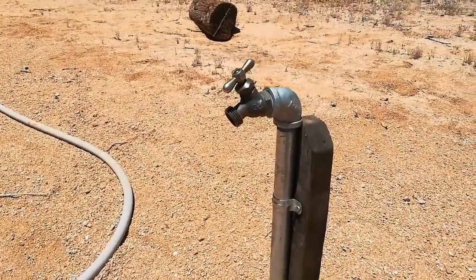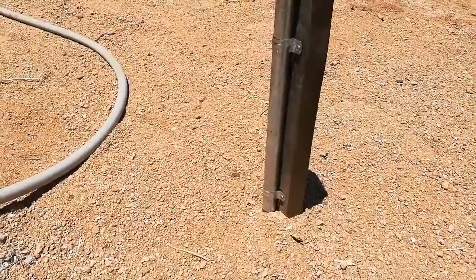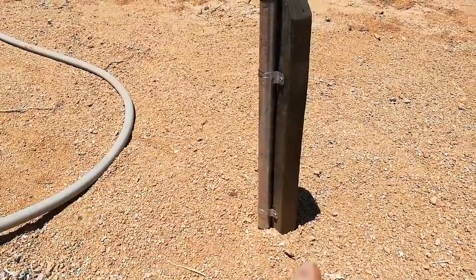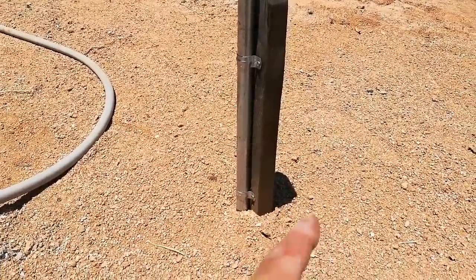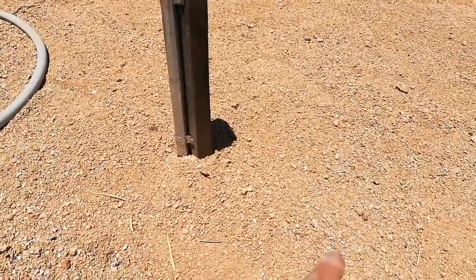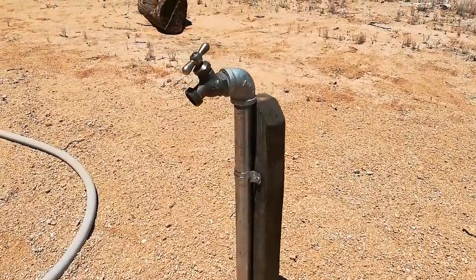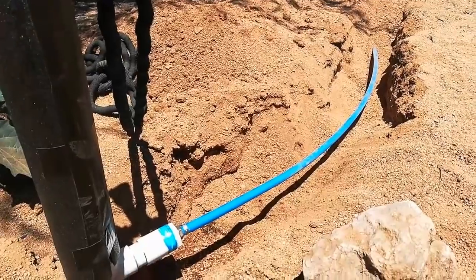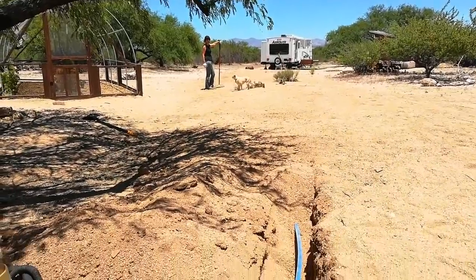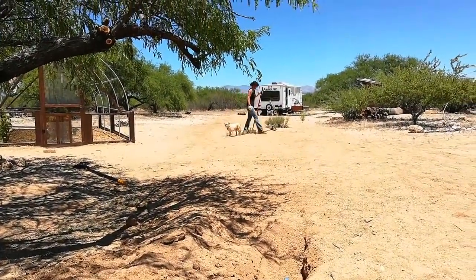This is the other end of the water line we just installed, directly behind the trailer, where we'll make our trailer connection to the water supply line. We have three-quarter inch galvanized pipe going down to a galvanized tee, and that tee has a male PEX fitting on it — similar to what I installed on the other end — as well as another PEX male on the side with about a 12-inch piece of PEX tubing with a plug installed. If we ever needed to extend the run, we could just dig up that pigtail, snip off the plug, and continue with a PEX coupling. We'll fill up the trench — Yvonne is already doing that — and if you have any questions, let us know. Thanks for watching and we'll see you in the next video.